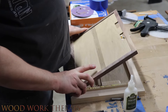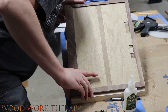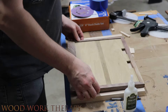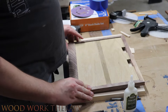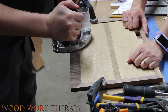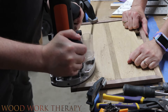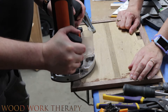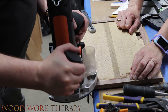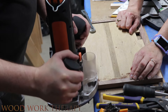Probably the best way to do this is just flip it over and tape it down — I didn't realize that at the time. Then we just took a router and rounded over the end there, so that way we have that nice palm rest to keep our hands on, so you don't wind up wearing out your palms on the rest. Obviously a sharp corner is not preferable when typing all day. We did a little bit of sanding after this to smooth that out, because it didn't come out all that smooth after the router.